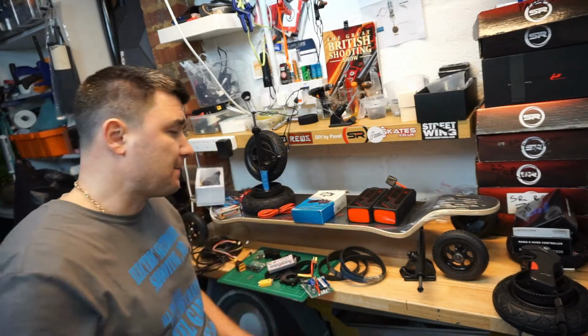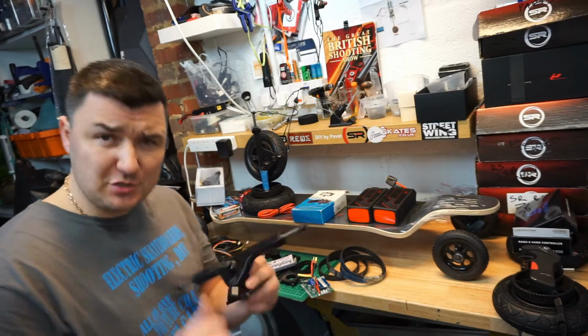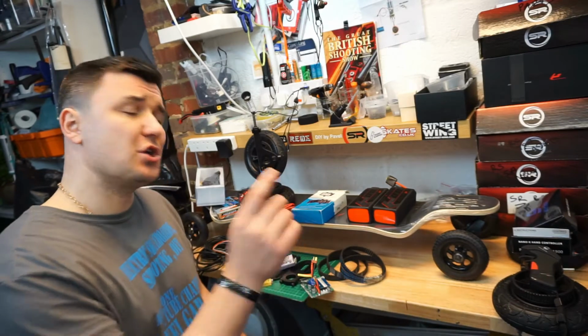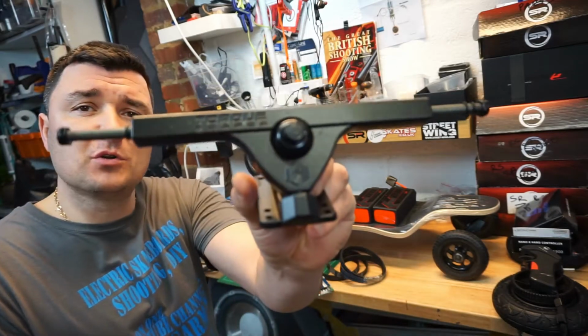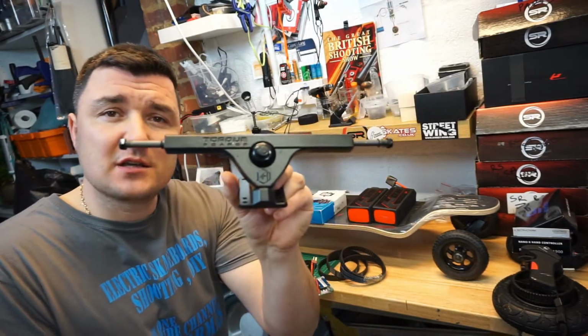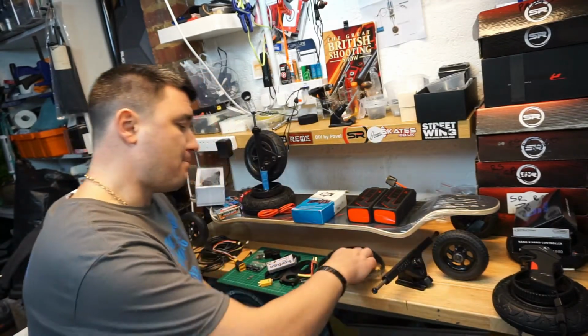As for the trucks, I'm going to go this time for wider trucks. For starters, you need wider trucks, minimum 218mm, to accommodate two 6374 motors. So this time, Torque Boards, 218mm trucks, front and rear. Very nice. You will also need some belts.